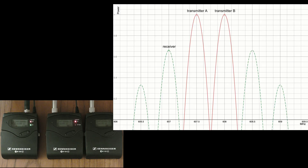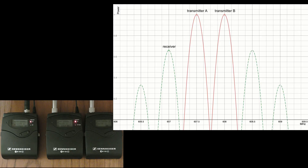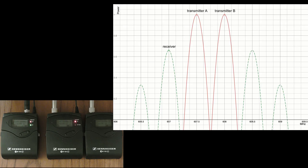I'm not transmitting anything on 607 MHz. I can prove this is a result of a sub-harmonic of the difference of the RF signals by RF muting one of them. When I do that, it loses signal. Same with the other one. Signal's back. Signal's gone. And it's back.